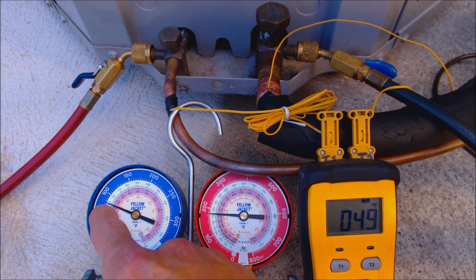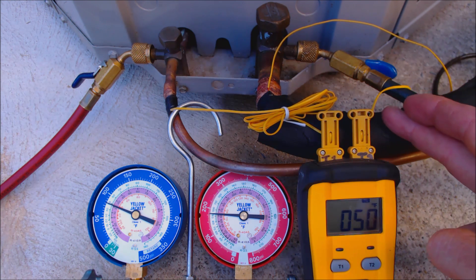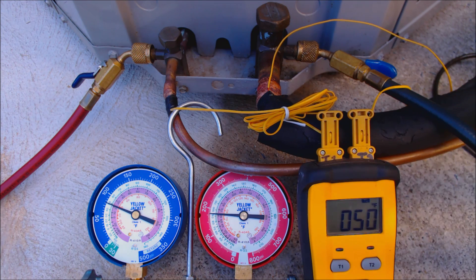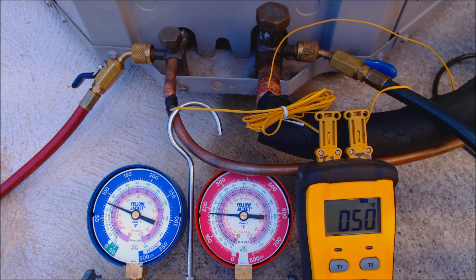Right now we're reading about 49 degrees and presently we're reading total superheat. Total superheat may even pick up a couple extra degrees on the way for the refrigerant coming back out to the outdoor unit. That's dangerous because the compressor needs to have vapor refrigerant. If it does not have superheat, it doesn't actually have complete vapor — it can have a mix, a saturated refrigerant still. At the evaporator coil, the refrigerant is supposed to get superheated before it comes out.